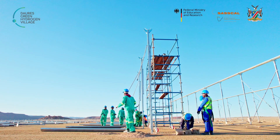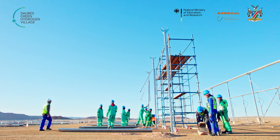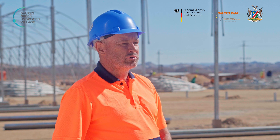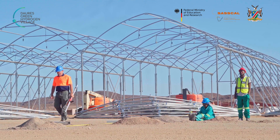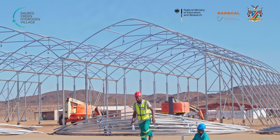The project consists of two parts of the greenhouse. The nursery, which is behind me over here, is going to provide the small plants to this main production area. The nursery is a pad and fan cooled house, so the cooling in that house is evaporative cooling because the plants are more susceptible to heat stress, whereas this main production house is going to be a naturally ventilated house with a roof that opens and closes.